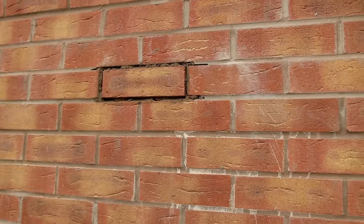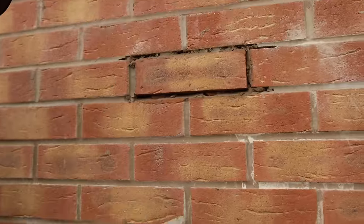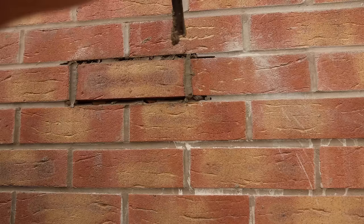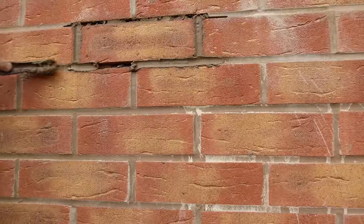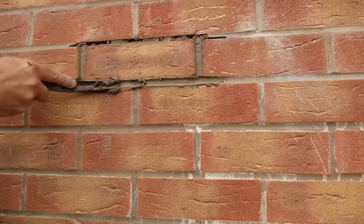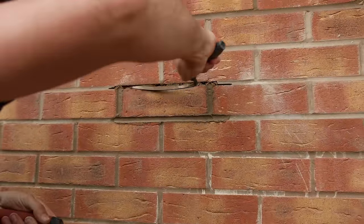Okay, that's good. Now what we'll do - joint it up. Get your jointer. This mortar is a little bit wet. Make sure that's full and this is full - you can do your preps or whatever first. A little bit wet because it's raining, but never mind. You're going to try and pack that in the best you can. Get that finger point through, help pack that in a bit.